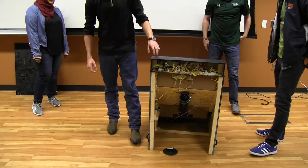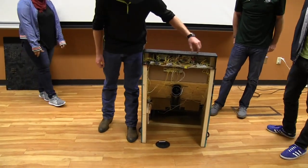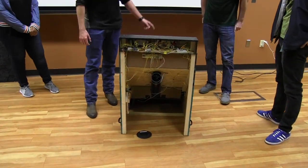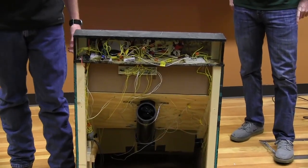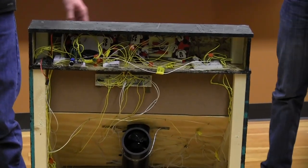With the exception of the Arduino running the soundboard, it is all controlled off of PIC microcontrollers. We have one 16F88 controlling what we call the command PIC — controlling when the game start button is pushed, the solenoid actuator for the ball release, and keeping track of the value of the ball count. So when it equals zero, it lights up the game start button.